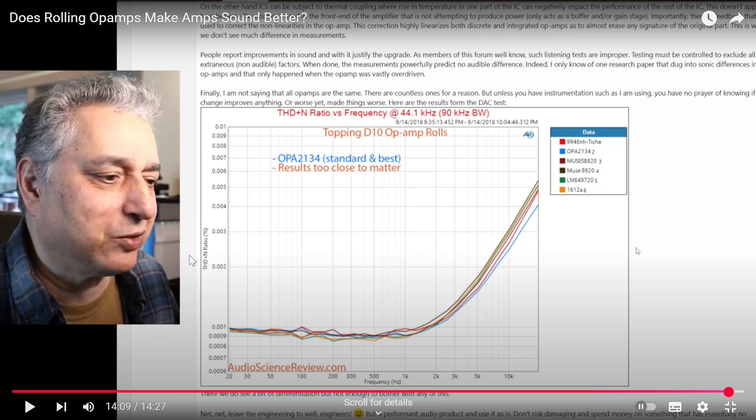Some statements claim that the operational amplifier used in the preamp circuits for the SAMP200 board isn't good and that there are better op-amps worth swapping in. I should say that is a false statement. Here are AMIR's measurements of different high-end operational amplifiers, and you can see the outcome: all those changes are negligible and inaudible. The results are almost the same while the price ranges differ — that means it's marketing. I really recommend watching some AMIR videos where he takes a bold statement and then measures it. AMIR has excellent audio measurement equipment including Audio Precision, an expensive device that can measure all aspects of audio. Sometimes when you have a bold statement it's worth seeing how it really performs.